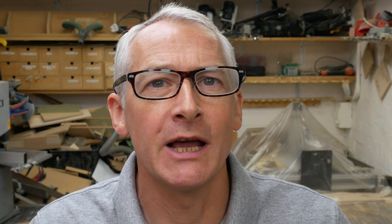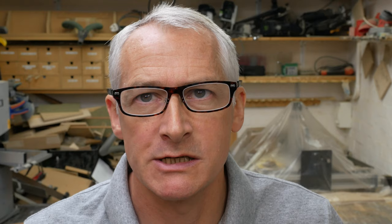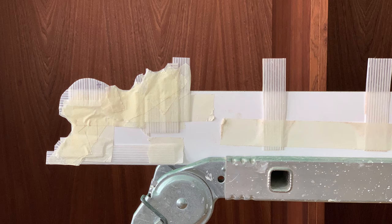With the carcasses all locked in place I can start scribing the infills above the wardrobes and around the sides. These infills have been sprayed to match the doors and I only have one of each, so I take this very slowly. Starting with the scribe to the ceiling and around the decorative plaster cornice — I fitted an MDF batten above the top boxes, set back from the front edge by the thickness of the infill, and added little plywood uprights just shy of the ceiling for the infill to bear against and glue onto. Because of the complexity of the plasterwork I first template the shape in corrugated plastic (Corex) and then transfer that onto a full-length piece of MDF, using that template to scribe to the ceiling again with little strips of Corex.